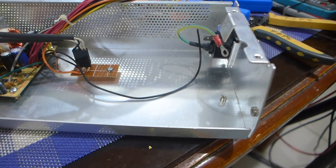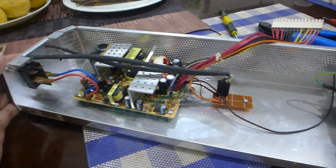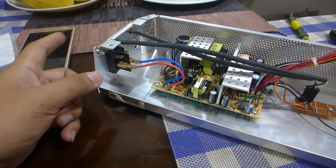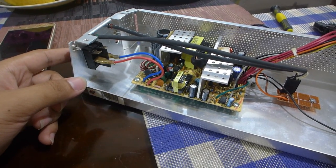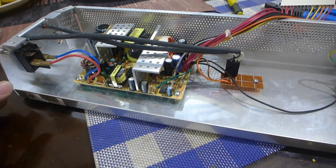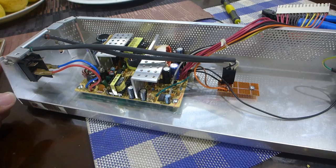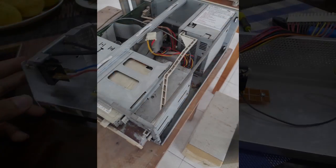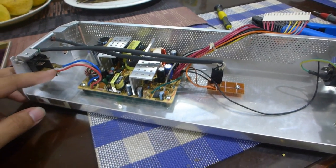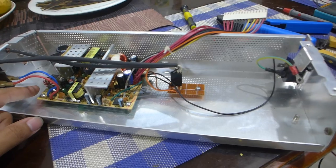But sadly, I can't really do that, but I might be able to get away with it as long as I flick the power switch with dry hands and not wet hands. Yeah, it was actually a danger with these old machines where, because the power switch actually has mains running through it, you can get electrocuted if your hands are wet. And on Korean computers, they tend to employ a safety stick of sorts, where it's basically just a bit of plastic that extends to the power supply or the power switch. I think IBM also did that on their later systems, but Hyundai and Samsung computers from Korea had that a lot. Even Samsung monitors also had that on their late 90s, early 2000s monitors. So yeah, I'll have to buy the needed materials tomorrow and continue work on this from then on.